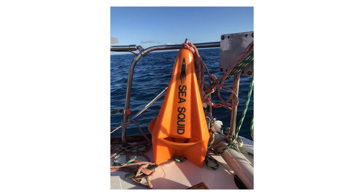The Sea Squid is very hard to stow, but I was very happy I had it. Mine has an eye hook on the top that has been welded so those forces can't open up that eye hook and you don't lose the drogue. I still had a trip line tied aft, which helps you pull the drogue backwards, frees the resistance, and makes it easier to pull on board — but it's also a triple safety so you don't lose it, because that's your only hope. I don't know that a Jordan series drogue would be the ideal thing for steering. If that's what you have, then that's what you have.